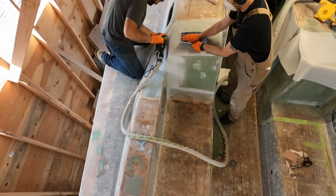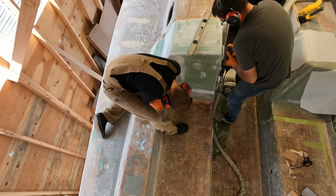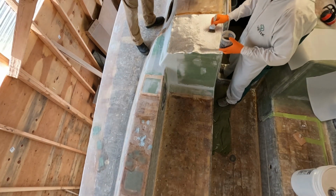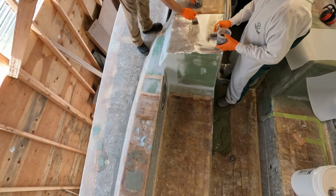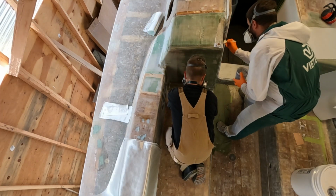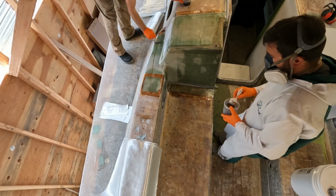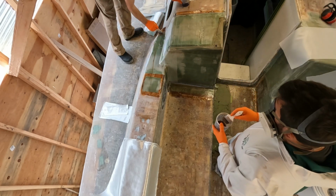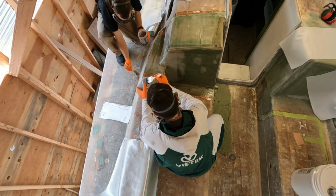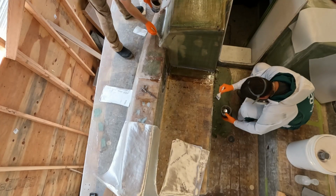that lately. So we did get the port side addition to the interior space slash reduction from the cockpit space glassed up, thanks to my buddy Chris for coming over and helping me with that. So that is now glassed on both sides with foam core on the inside. And both sides are done, so now I just need to go on the interior, sand out the inside there, and then glass those two together so that it's fully feathered on the top side and on the bottom side. It just makes it really integral and strong.